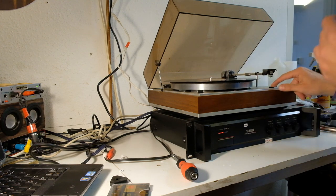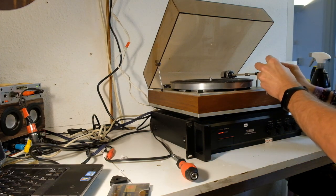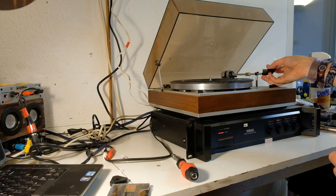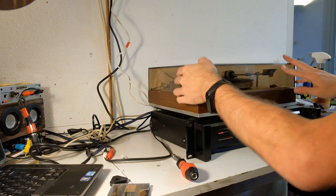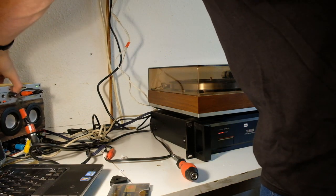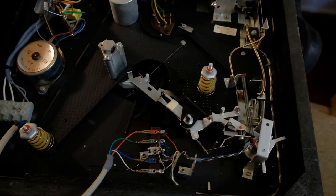So what I think, because this sounds a bit weird — either there's something wrong with the cartridge or the headshell. We do have two channels. There may actually be an amplifier in this — these were sold with built-in preamplifiers, and this may be one of them. But I don't think so. I'm sorry to say there's no preamplifier, so there's something wrong with either the wiring or the headshell or the cartridge.